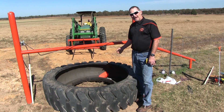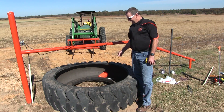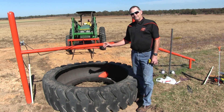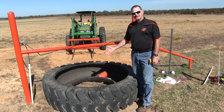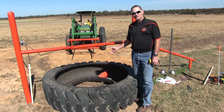We put a regular valve in, and we like to protect it on the lip side instead of going up through the middle. I've seen lots of tires that have the plumbing go up through the middle, but we're going to cement that middle end. So if we do have anything break, we don't have to cut through that cement — we can always just replace that piece of pipe through the tire itself.